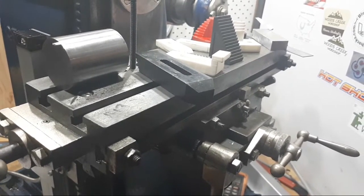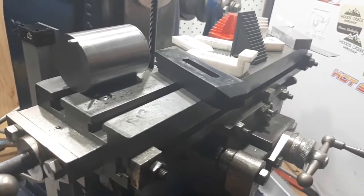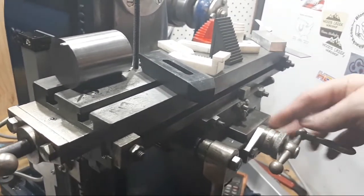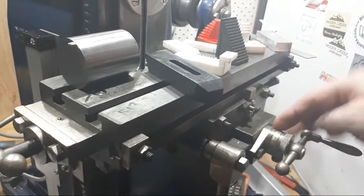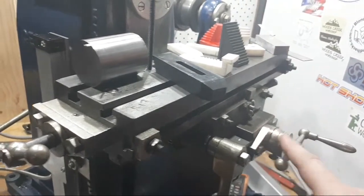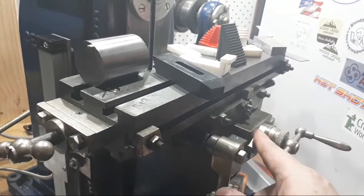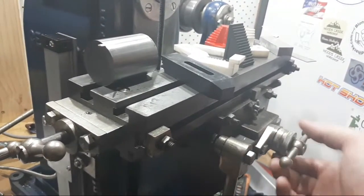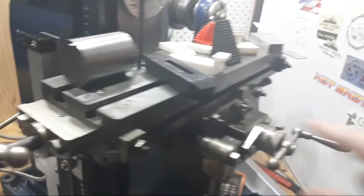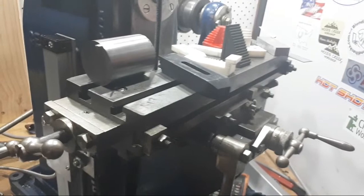Yeah, it's lead alloy, but it's not bad stuff. And for a lot of things, it's great. If you're making hand wheels and things like that, it's awesome. So I could do a prop out on this if we put a longer lead screw in it. If I ever finish this and put a new lead screw in here, you could easily drop this out another 20 millimeters and make this bush here that much longer. This isn't much good as it is with the 8 TPI lead screw, because each turn's an eighth of an inch. That's a real pain. That's why we put the DRO on.